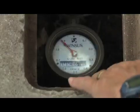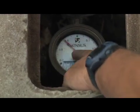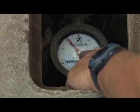One of the other uses for the meter as a tool is to measure how much water flow comes from our appliances. The easiest one to measure is the toilet. I'm going to have someone in the house flush the toilet. We mark that this red arrow's on the 0.9. Let's flush it. And it's going to have to flush through.